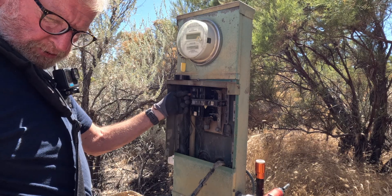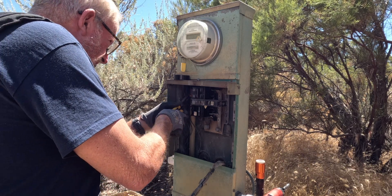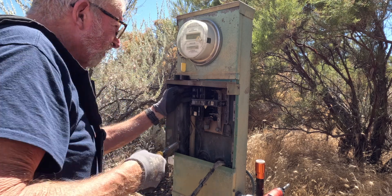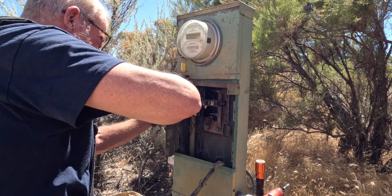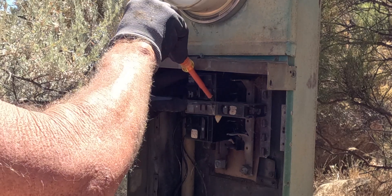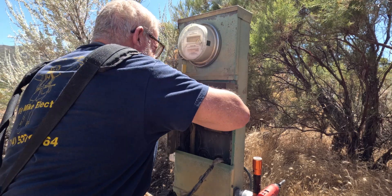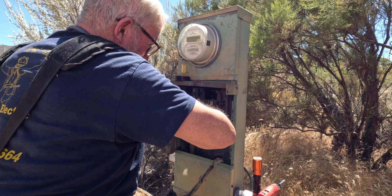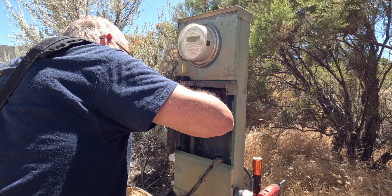How much power is coming through that right now? We've got 100 amp potential here, and even worse, the only thing that's protecting me is the fuses out on the street. It's hot — get in there. Sometimes you've got to talk to it. We've got to be very careful. This is hot. Don't angle your screwdriver — concentrate on what you're doing. They do make screwdrivers that are insulated just for this reason. Here's my big Klein — I'm going to finish this off with my big Klein. There's probably a torque setting on this, but I don't have a torque wrench with me. That's damn tight.